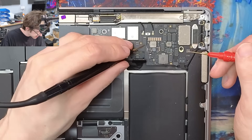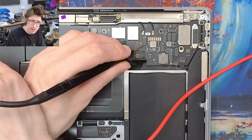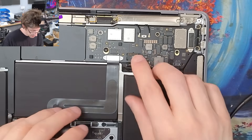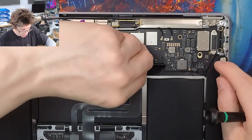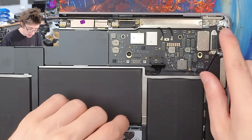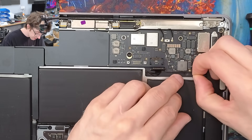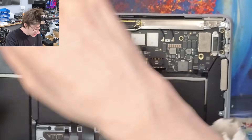I'm going to preemptively stab the audio board over here because that's a classic. There's no main rail short — well, that's disappointing. Let's get the motherboard out, let's go digging in a bit further. That kind of short circuit we're seeing looks like it might be an input short. I saw on a recent laptop there was a blown protection diode at the USB input that was causing a big short circuit right at the input, and because it was all at the USB input it did not show up as a main rail short. So I'm kind of hoping we might have a similar deal here, which would explain why we're not getting any immediately obvious issues.